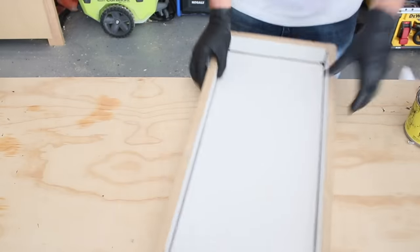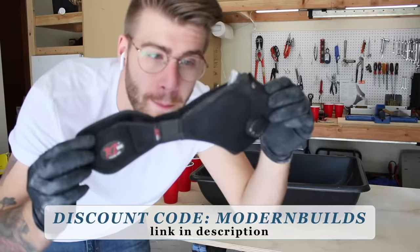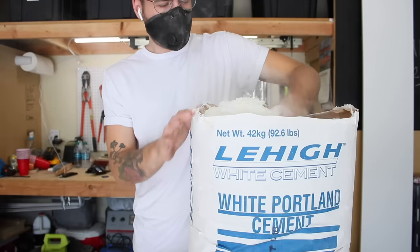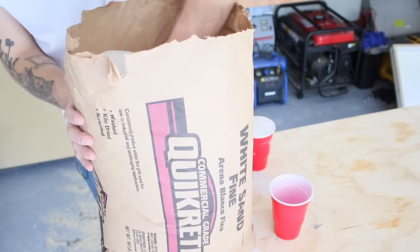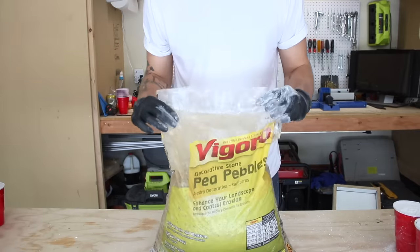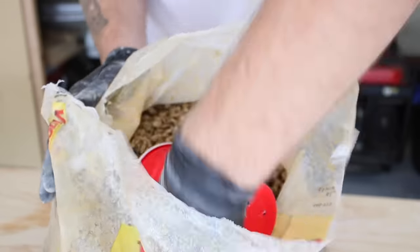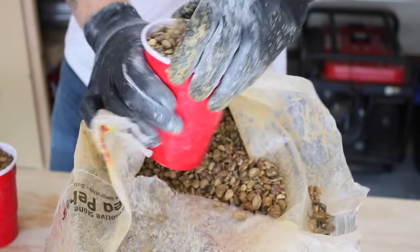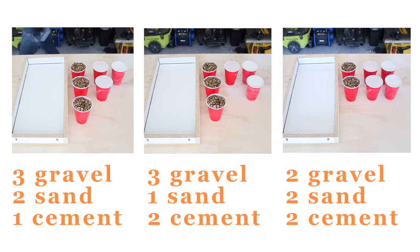The only problem was that I needed to make a lot more forms for all these tests. I grabbed my RZ mask before mixing any dry ingredients — whenever you mess with cement there's a lot of dust and you do not want to breathe it in. For my first concrete test I'm using one part cement, two parts sand, and three parts pea gravel. I drilled holes in the bottom of the scooping cups so I could rinse the gravel so it didn't stain my white concrete mix. Each test will have different ratios to find out which gives the strongest result.